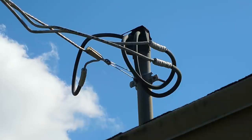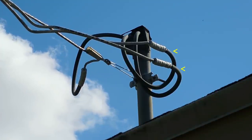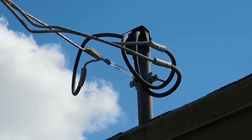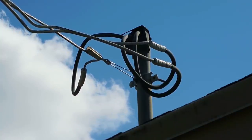If you take a look at the far right side, you're going to see where the two lines — line one and line two, the two hots — are only about that far apart. And believe it or not, the insulation that used to be on that crimp connector is gone. Both of those are live. The first thing I'm going to do is take you up on the roof, show you that there's live power at those two connections, and then I'm going to very carefully wrap them because I cannot work on the masthead with those two connections like that.